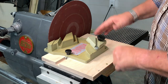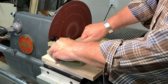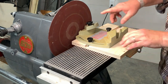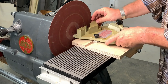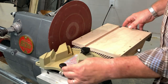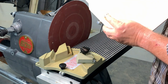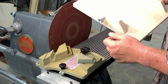I just slide the headstock over, sharpen, and go back to work. My round nose scraper sharpens the same way. On this side the disc is moving up — I actually want to be on the side where the disc is moving down. Some people like to sharpen up at the top, which I can do by adjusting the height of the extension table. That's why I ground that off — I like sharpening on the downhill side of the disc. Basically all I've got here is a flat edge made of scraps. The miters are not critical — a flat edge, a carriage bolt, and a T-nut. You could just drill and tap that hole. I've got a Bittner knob and Bittner nut installed.